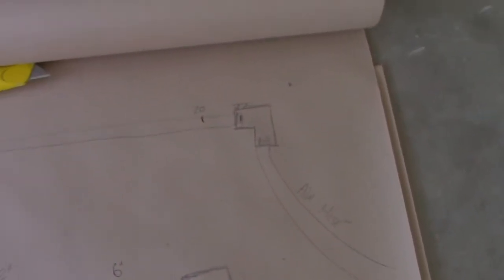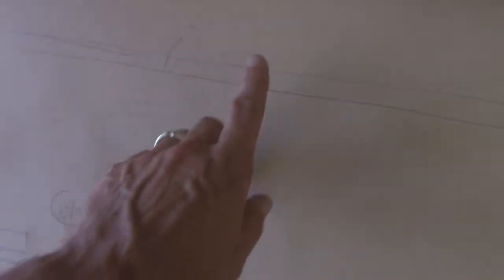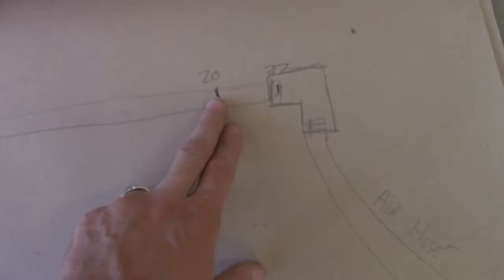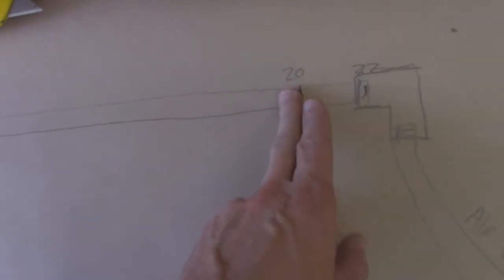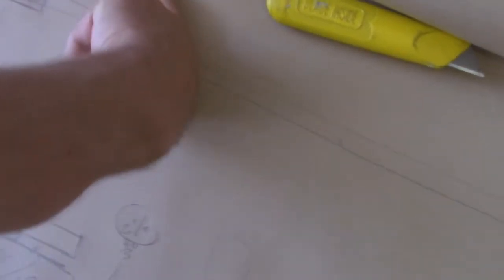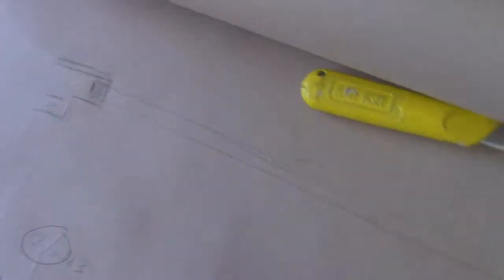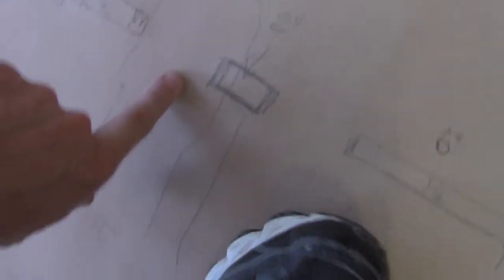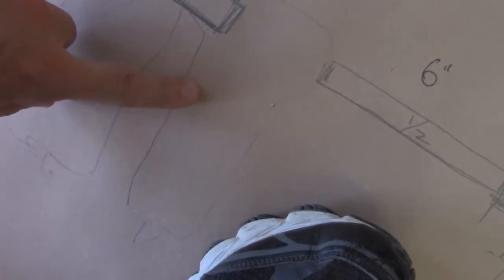So basically this is my diagram of how I had it. It's air hose coming in, elbow, it's going straight up, but right here I'm going to have a T fitting. Because I couldn't find a 20 to 24 inch threaded black iron pipe, I went with an 18 and then a 3 inch, because I'm going to have a T fitting that's going to come up. It's going to branch off with that 1/4 inch, so I can have just an air line that's going to come straight from the air compressor. I'm not worried about a little bit of moisture getting into whatever, so I can actually save my desiccant dryers, because that's my dryer here, and has an extra filter dryer here before it comes down to my desiccant.